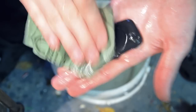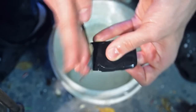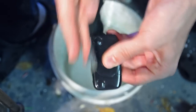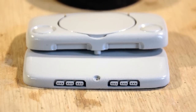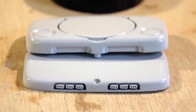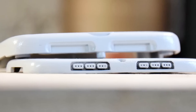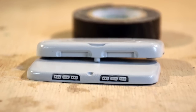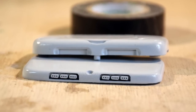After that, a coat of plastic primer is sprayed on the case, followed by a first coat of paint. The first coat needs to be pretty thin. But already, the case looks great. The paint is uneven and didn't get everywhere, but still, it looks promising. A few more coats and the case should be done. Hopefully, only two to three more coats of paint are needed — if there were any more, the small details in the case would be masked by the excess of paint.